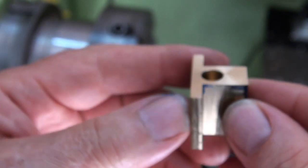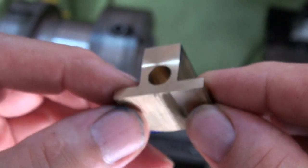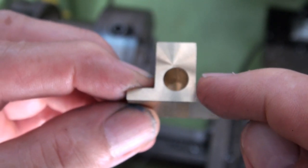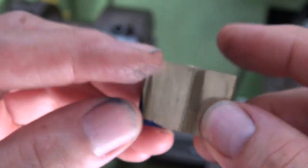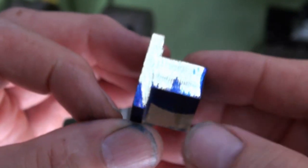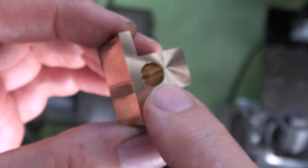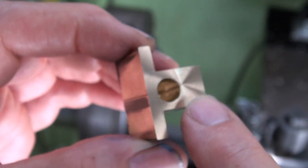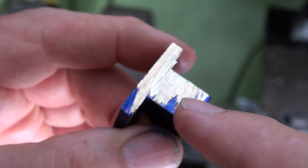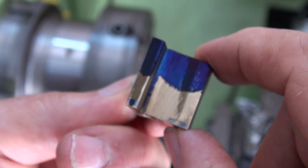So what you didn't see me do yesterday was I cut the brass bearing stock in half. These are the drill holes that I already put in on the CNC mill, and this is the sawn face on the back. So what I'm going to do next is, I have already machined one face in a 4-jaw chuck on the lathe, and I'll reverse that and machine the other face until I get back to the required thickness, which is 5/8 of an inch.